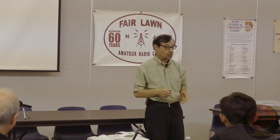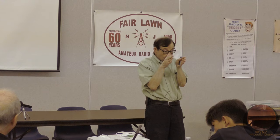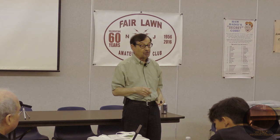In fact, when I'm operating on 3 centimeters with my big dish, and it's not very good, it shouldn't work at all at 3 centimeters, but I look at the moon noise, and I can tell I'm on the moon by just looking at the pickup of the excess noise that the moon gives you. So that becomes a factor in the equations of what you're going to receive, because depending on the beam width of your antenna, if you have a really big antenna and a high frequency, the noise from the moon itself can be a contributor to your minimum noise.